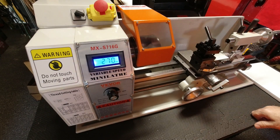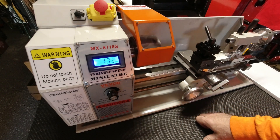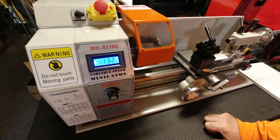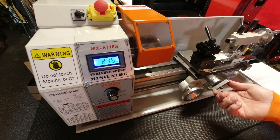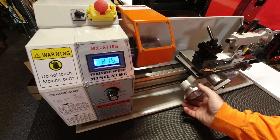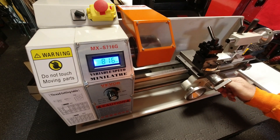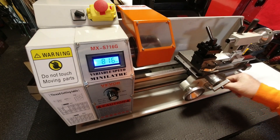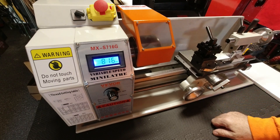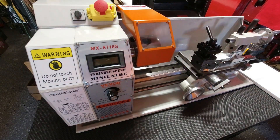I did grease the metal wheels so you're not hearing anything from the wheels — it's all the actual motor. We're going to call that 2500, we'll round up. But we don't get a zero — we tap out at 126. So maybe that's some troubleshooting to look into. This does work. That's the same function as the emergency off and on, so I'd have to turn it back on again. Maybe I'll call them to find out why I don't have a zero RPM when it's set to zero, which is obviously not the greatest thing, but we're in a better spot than we were.